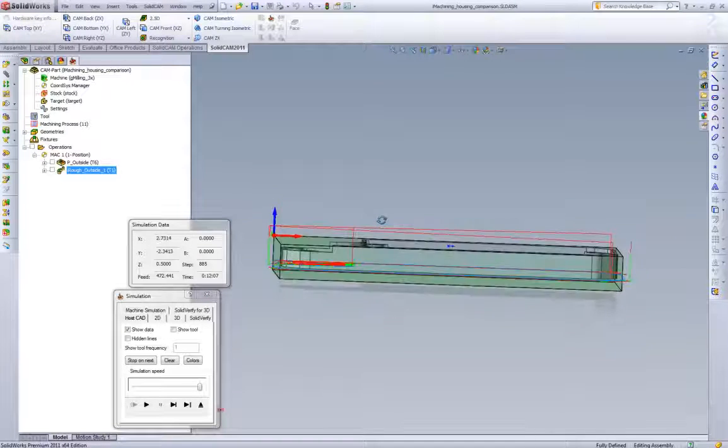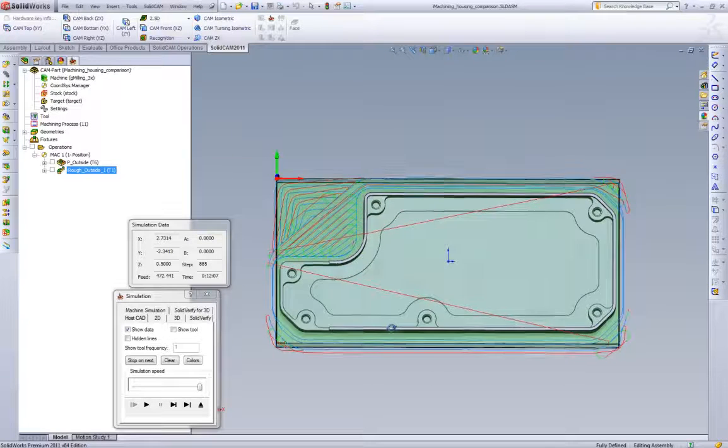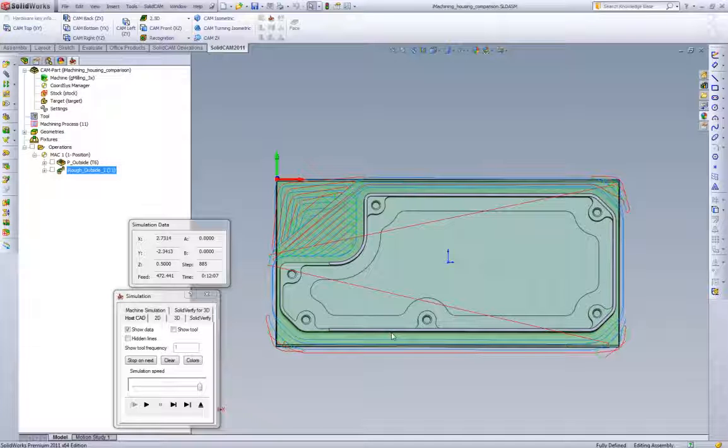First, as we look at the toolpath, we see there's very little clearance and retract movement. Because iMachining is doing smart repositioning and always staying in the cut, as we look at this part, we're not wasting any feed Z moves, and we're not wasting any clearance moves. So you're getting a very big optimization just by keeping the tool down inside the cut the entire time.